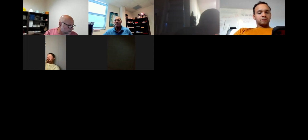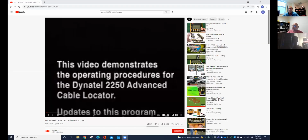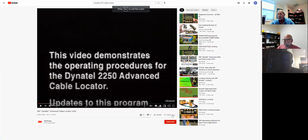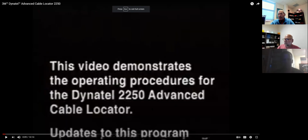Okay, while he gets that screen in preparation, when you guys were out there at the field and on the underground part, where was our cable at in the ground? How was it installed? In a conduit? In conduit. So if I have a customer complaint of bad voltage and I've tested it and I need to repair it, what do I need to do? Pull it out of the conduit? Yeah, pull it out, pull a new piece back in, you're finished.